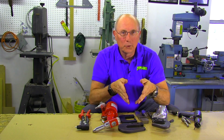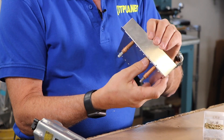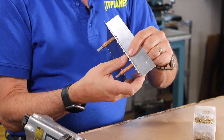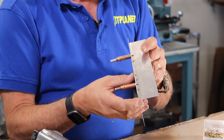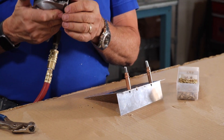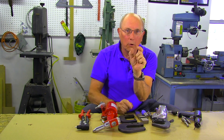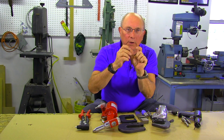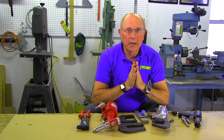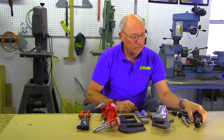Once you've cut, deburred, and drilled your metal, you're going to have to fasten it together — and that's generally done with rivets on a metal airplane. You'll use screws for removable things, but once you've riveted two parts together they are permanently attached. Basically you need to squash the rivet: you put it through the hole, you've got a factory head on one side and a shop head you're going to form on the other, and you squash it either by squeezing or by hammering it with a rivet gun.